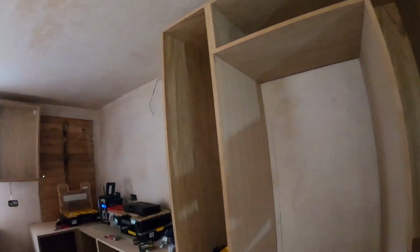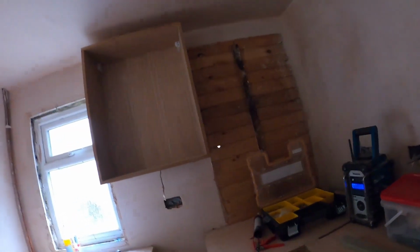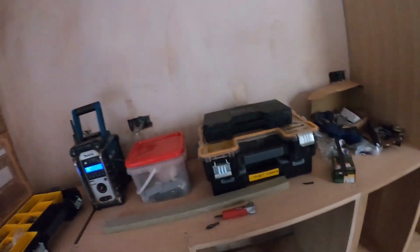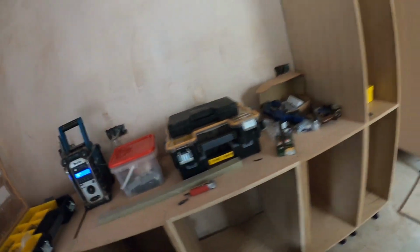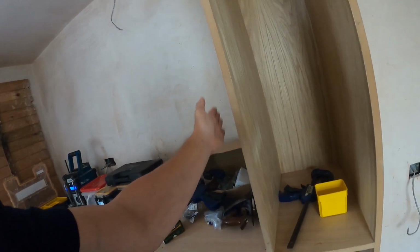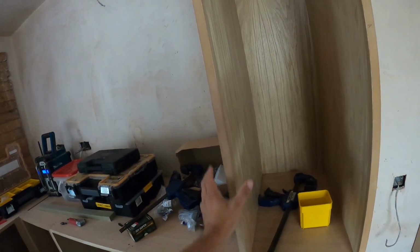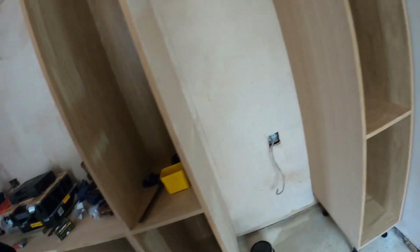So next thing for me is start framing it. That will be done in the thickness of these cabinets, so 38 mil frame all the way. That also allows us to fit end panels in MDF on the side and then frame on the top to cover the edge. That's my next job. I have end panels here as well, end panel, end panel, end panel.